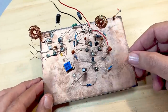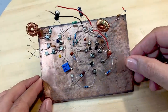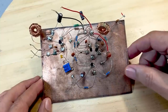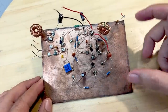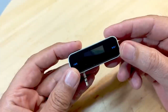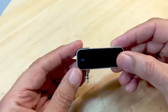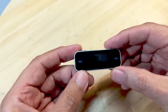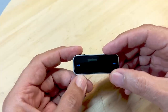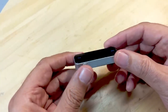This is the project's humble beginnings — really humble. A real mess on a piece of printed circuit board, everything accessible. The printed circuit board itself becomes a ground plane, which allows you to add, remove, test, and access any test points you might want. Some of you may remember I used a little FM transmitter to test some of my radios originally. These things are very common — you plug it into your phone, transmit the earphone signal on FM so you can pick it up on a car radio. Very low power but pretty good quality and very cheap. But I wanted something for AM.